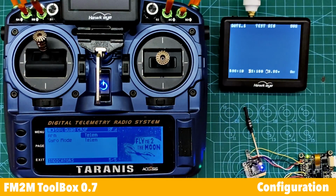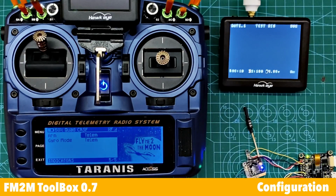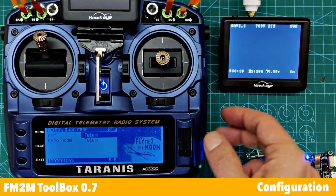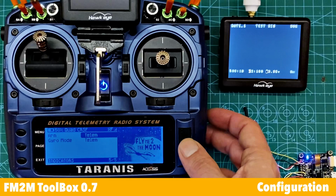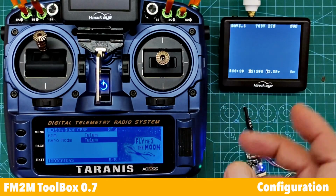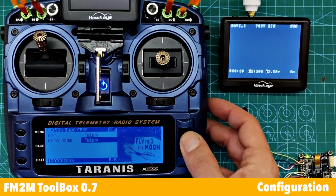And there are the rest of the indicators. They are set to telemetry initially. That means all the data, all the settings are based on what telemetry says. First is arm. You saw it when you armed, there's this inverse happening. And the second one is gyro mode. That means acro mode and horizon or stabilized mode.